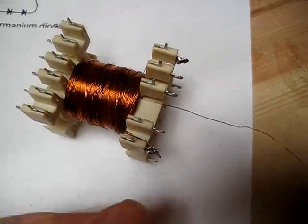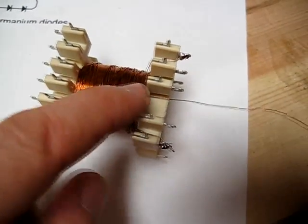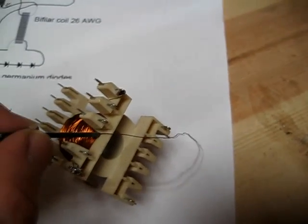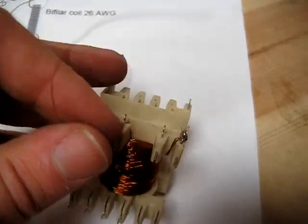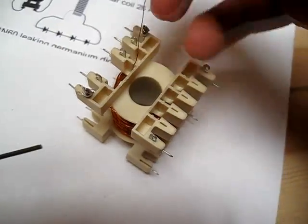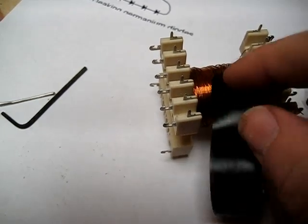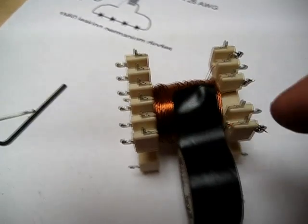Now we're ready to attach the last lead on these fine 30 gauge wires. The next wire we put on this will be the larger gauge wire — the outside primary. I spoke of the way it exits previously and you really want it to come out clean, right down here where we started the high voltage wire. We want it to come on the inside of this channel and wind onto this lead. I'm going to take black electrical tape and put a thin layer — going around once on this side, then one more time on the other side so the whole section of wire is covered.